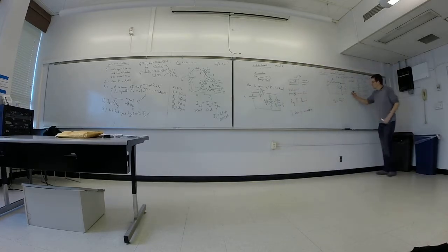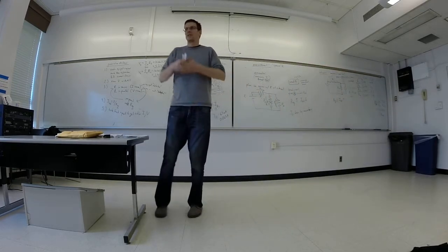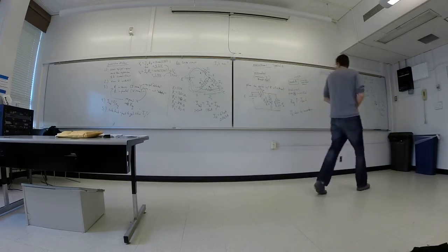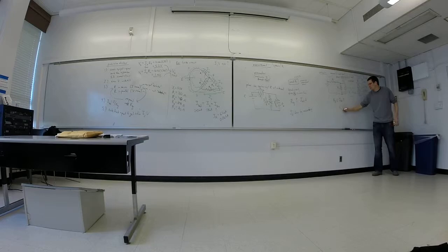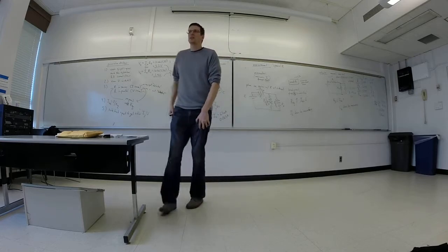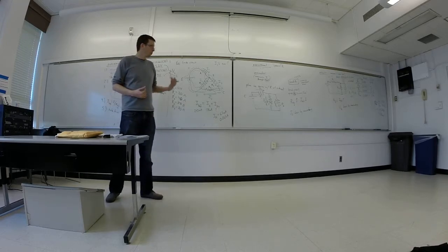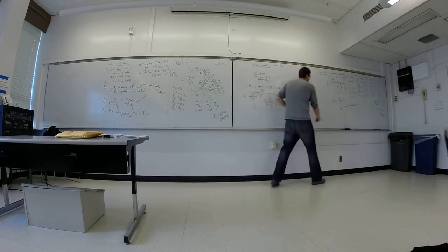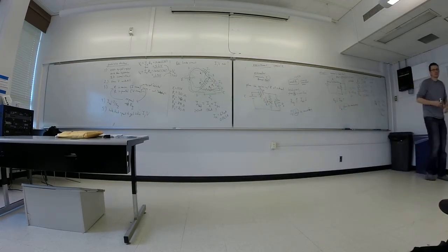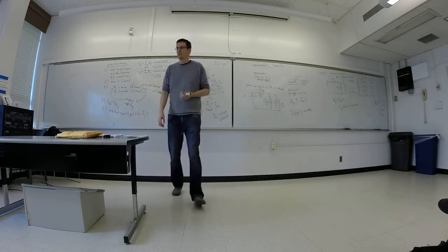Okay? So again, when you go from R2 to the R2 voltmeter combo, that decreases the resistance, and that's going to decrease the voltage drop across that section. So again, you have an effect on this circuit by measuring. So V2 is going to again decrease by the act of measurement. So if there's one takeaway from how measurement devices work, the takeaway is that the act of measuring will lower the thing you're measuring. That's true for both of these. Notice that the common thread is a decrease. Anytime you measure something, you're actually measuring a value that you've artificially decreased by attempting to measure it.